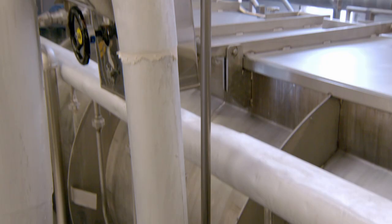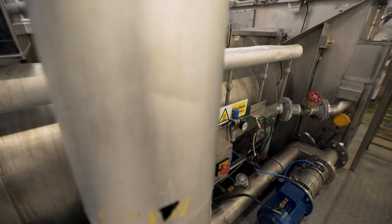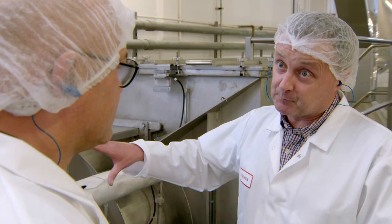Inside this machine, the cold cubes are warmed in water at 85 degrees C. They're in there for about two minutes. The reason you blanch them is to get the potato warm enough to get ready to be steam-cooked — if you didn't, they'd just turn to mush.